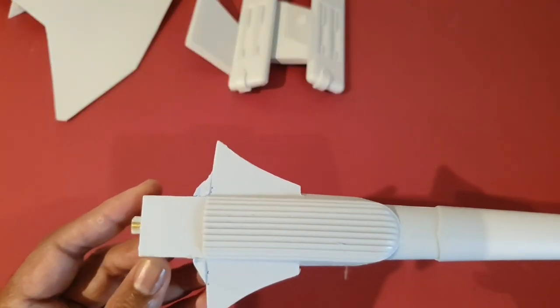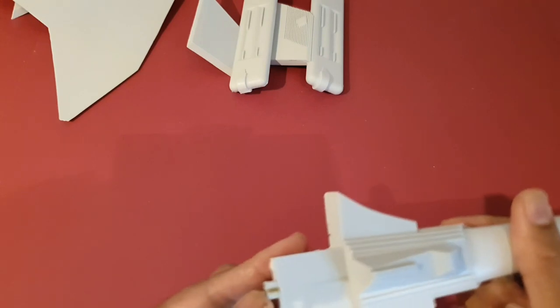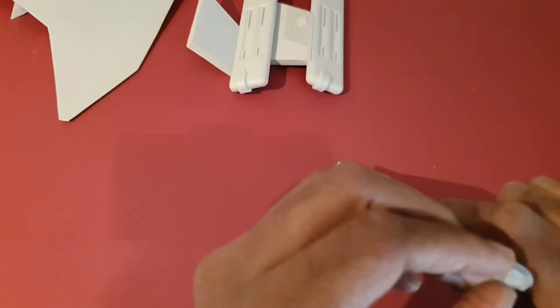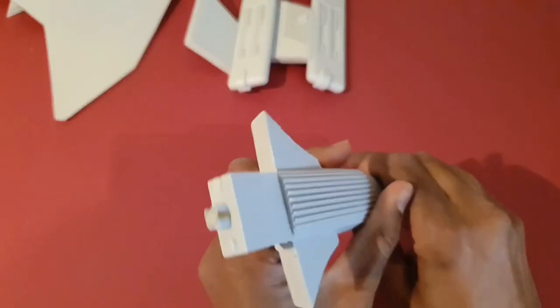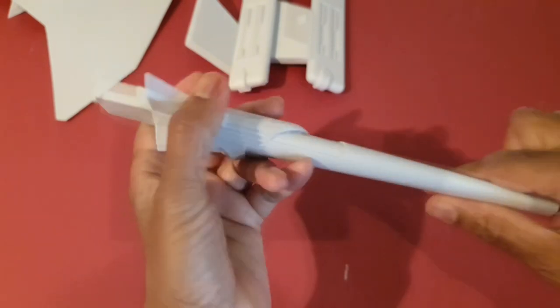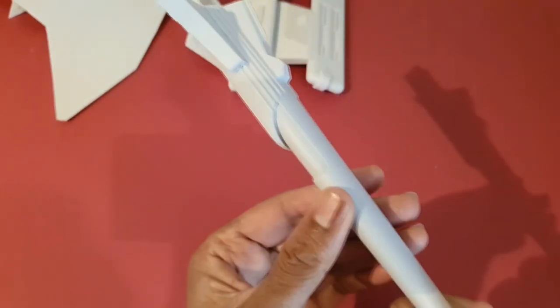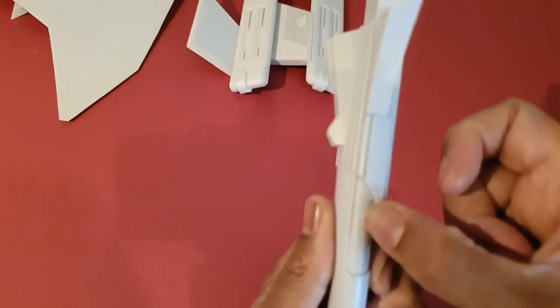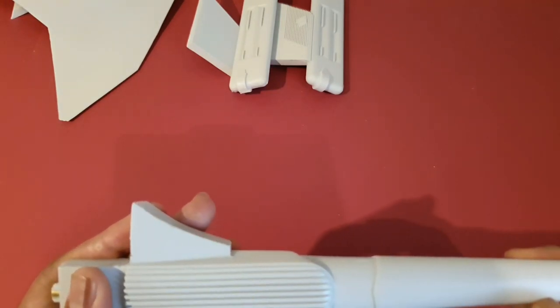The neck. First of all, there's a bit of flash there that'll have to be removed — most of it could just be pulled away. There is a metal rod that runs through it that has unfortunately become blocked, so I'll have to figure out a way to clear that out — probably just drill it out. The seams will need to be cleaned up nicely. Casting is smooth except for a few small bumps, which light sanding can take off.